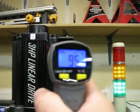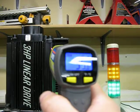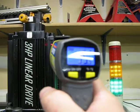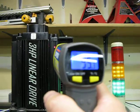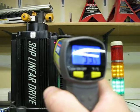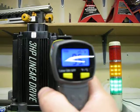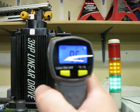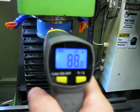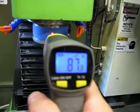The motor will eventually get up to about 130 degrees Fahrenheit. I'm not sure if that's going to be a problem. At this point I'd rather break the spindle sooner rather than later - if it's going to break I want to know now so I can figure out a plan to switch to another technology, probably an AC motor with a VFD. I'm not going to abuse it, but I'm not going to avoid running it out of fear either. If it's going to break, I want to know about it. That's the update on the spindle - now I'm going to actually try to use the machine to make a part, and maybe I'll make a video of that later.